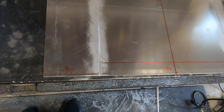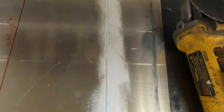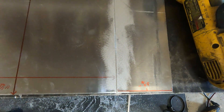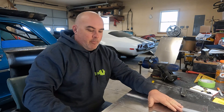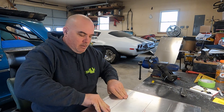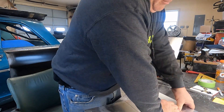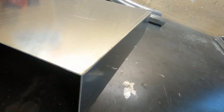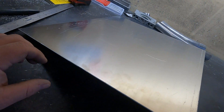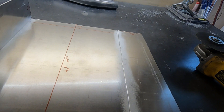Just like I said — four-and-a-half inch grinder, just scribe the lines about halfway down. As you bend it you might have to grind a little bit more until you can get it to come around. Ready to bend this — hopefully she goes pretty easy. I got one side all bent up. It got kind of hard trying to do the whole thing by hand, so I decided to go over to my Harbor Freight metal brake and was able to get it to go around. One more side to do.